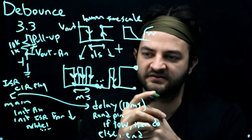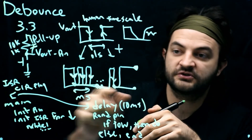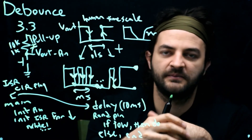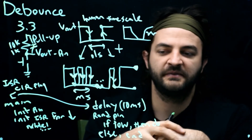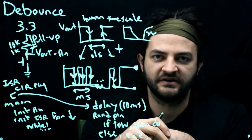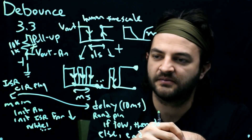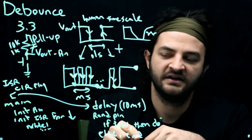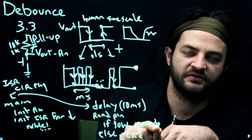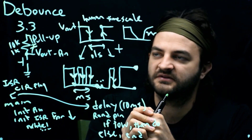There are lots of ways to debounce — this probably isn't even the best way. Think about how you want to do your debounce code. Draw a picture like this, because it's important to think about the macro scale and the micro scale time-wise. Implement it in code — this was pseudocode, so write your actual code. For this week, you're doing two things: writing this debounce code (you don't even have to test it), and building a more complicated stopwatch project. Every time you push the button and go into the ISR, do the debounce. Stick this code before the action — the action being: record the time, record the time again, subtract and print. That's how you do a stopwatch.